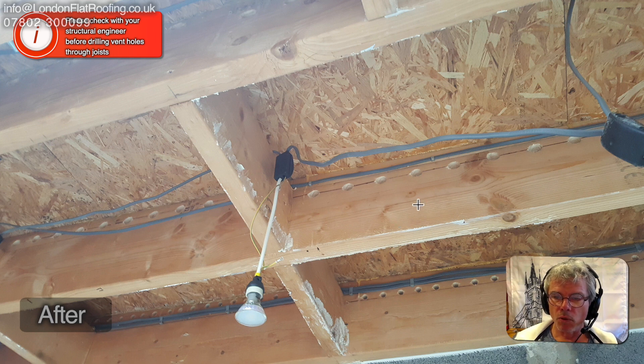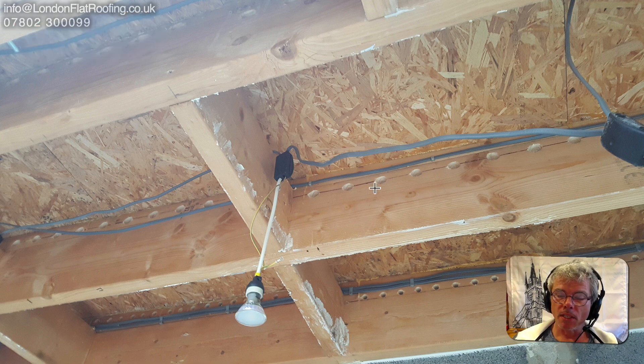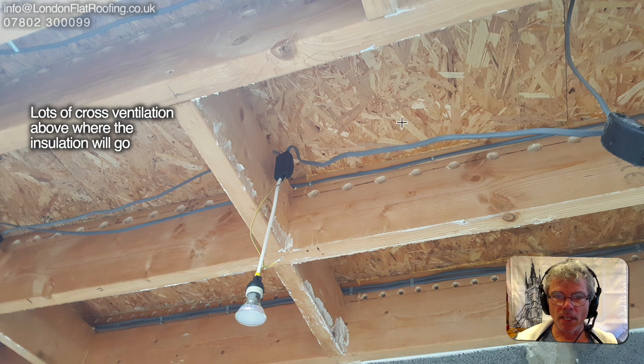Here he's dropped down — probably because of a cable — into the depth of the timber. I've talked to him since, because has he changed the dynamics of the timber? This timber being an 8x2 was there for a reason because of its span, and you've got to be careful because structurally that is really changing things. But luckily this timber is well oversized — it's only spanning a three-metre span so he could have got away with 6x2s. So the fact that the holes are in the timber doesn't cause a structural problem, and you've now got freedom of movement for air once the insulation is put in — blowing in from the side and across.